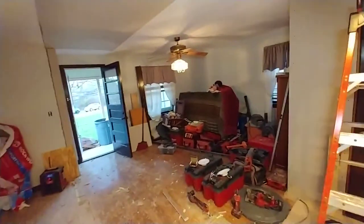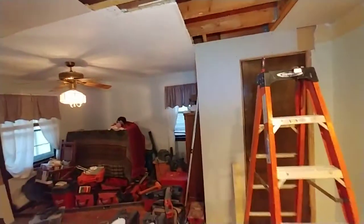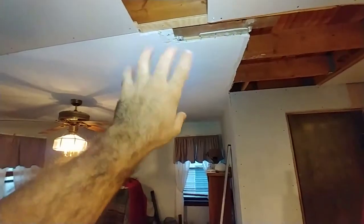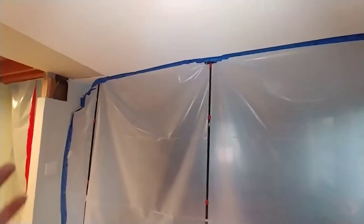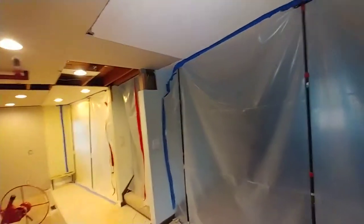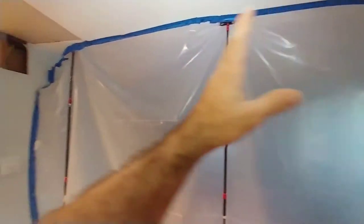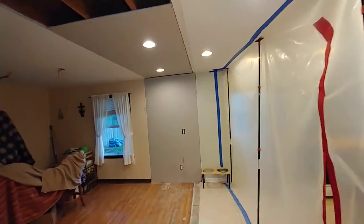There's just lots of stuff going on here, but we're going to get it blended and smooth. What I told the customer was: if I had been doing this in my own house, or if you're doing this yourself at home — if you can get all your furniture out of here, or cover it all up — the thing to do is get it all the way you want it. When you've got this old, extremely heavy, thick mishmash of material on the ceiling and you can't move your light fixture, find a couple of reasons to justify it, but basically tear it all down. Take the whole ceiling right out — especially if it's popcorn, don't even bother scraping, just take it all out. Go around the inside corner where the wall meets the ceiling, cut with the Sawzall, pull it all down, and you can put your fixture boxes and can lights exactly where you want them.